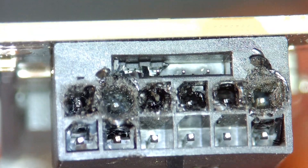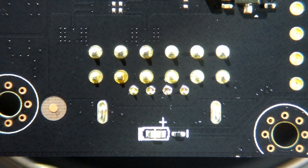Okay, so we're going to go about replacing this right now. I'm just going to gather up some tools and we'll look at removing all this solder. Alright, everything's ready now — our solder iron's up to temperature. What we're going to do is warm the board up using the hot air station, and at the same time I'm going to be applying a lot of low melt solder to these pins.